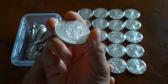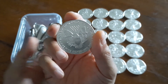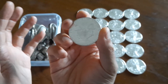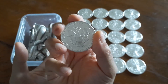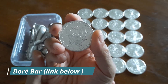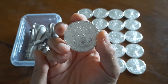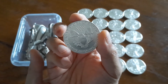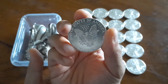Once the precious metals are extracted, they are typically melted into bars of mixed concentration. At this point, we're not separating the precious metals — silver and gold are kept together and melted at the mine. This alloy is often called doré. The silver and gold mixed alloy is sent to an assayer mint who performs analysis of the precious metal alloy and determines the best method of separating it into individual pure metal elements. The process is called parting.